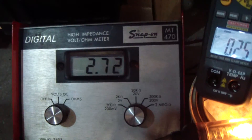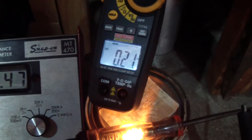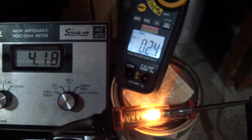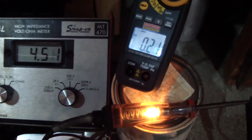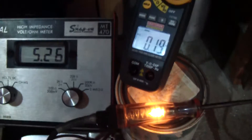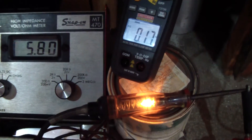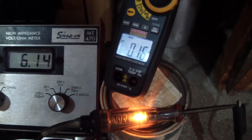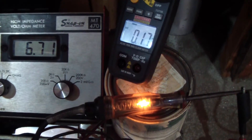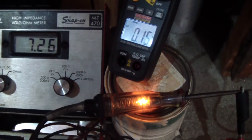There's some activity on the amp side — about 0.2 amps, that's what the test light is drawing. Now we're up to 3 volts, 0.2 amps, and the test light is bright. As soon as the capacitors start becoming fully charged, that glow will get reduced. The reason you do this is to prevent sudden voltage and amperage going to the capacitors, which may damage them and shorten their life. By using the test light as a ballast resistor, it gradually charges the capacitor so they won't get damaged.